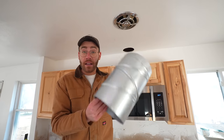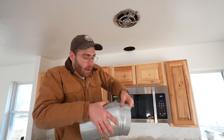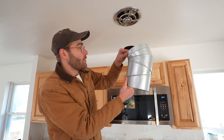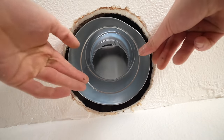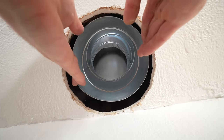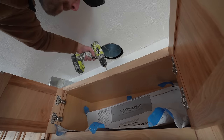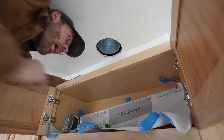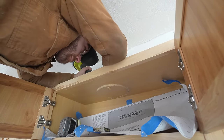I'm hoping I don't have to climb back into the attic to get this elbow connected. The roof is sitting at an angle so I rotate it to match. Our process for making sure the center line was true all the way through worked out awesome, and we're able to fit this easily — it lined up perfect. The last cabinet alteration I needed was a hole for the 7-inch ducting to feed through the top of the cabinet. I forgot to hit record with the jigsaw, but I finished the cut with a multi-tool.